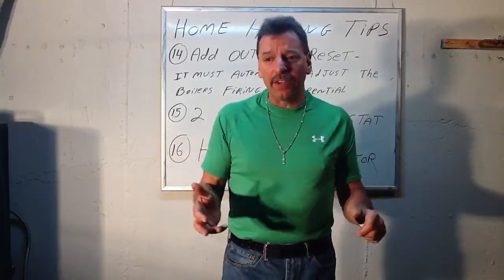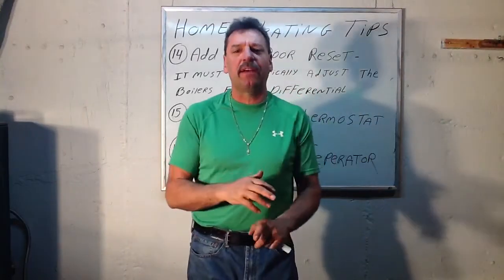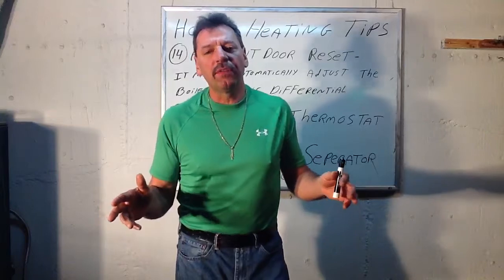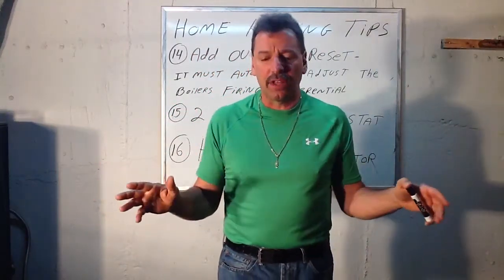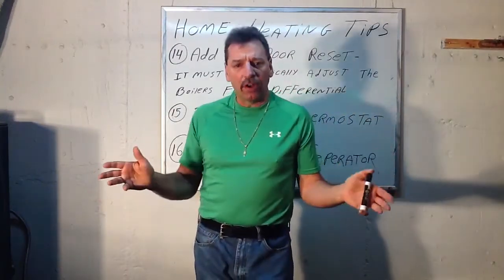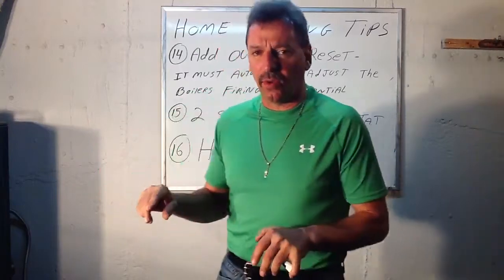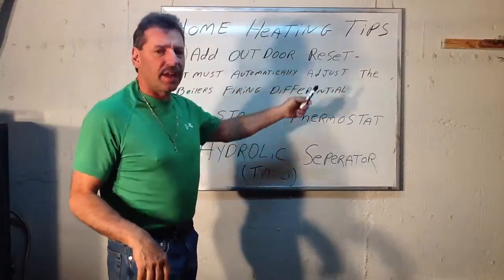So if your wife is a little chilly — it's 64, 65 degrees out and she wants that comfortable 69 or 70 degrees — it knows it only has to make up a 5-degree difference. With warm water already in the boiler, it may decide to just turn on the circulator pumps and say we don't have to use any fuel. We can make up 5 degrees with 140-degree water that's in there now. It holds the boiler from firing and takes over the Aquastat, saying let's just circulate the water. The outdoor reset is important because it really saves a lot of fuel.